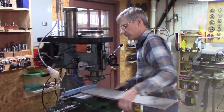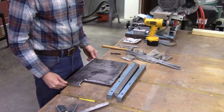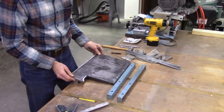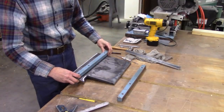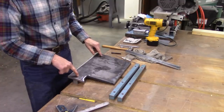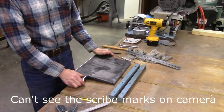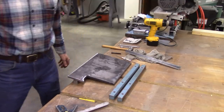I hope you enjoy the video. Well, I've got this not-so-ideal piece of steel here — it was given to me, so I guess I can't complain. I'm going to attach this to the bottom right about there, and this is going to be my clamping bar. I'll trim the ends off and use these existing holes on this. These will be clearance holes and threaded into this, and these will be countersunk flush screws, so I'll have to drill those clearance for five-sixteenths and then thread into that. I'm going to get started drilling, so let's go.